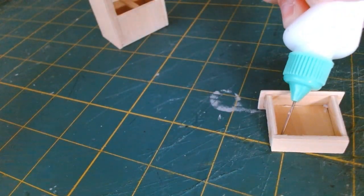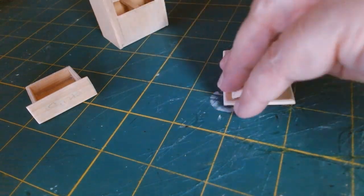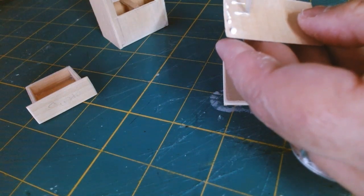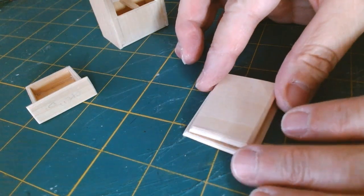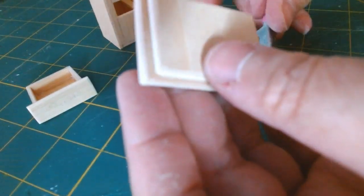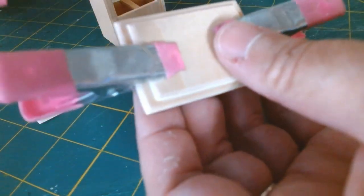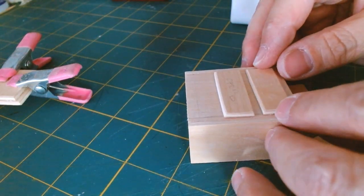I put the bottom into place, I'm cleaning up the glue and letting it dry, and adding some glue on the inside as well. Now I'm working on the top panel — I've already cut a double piece out and I'm gluing it right to the top piece. I've beveled all the edges on both panels, and I'm using clips to hold it nice and tight while it dries.